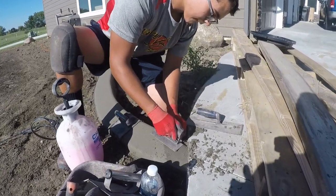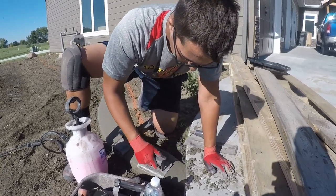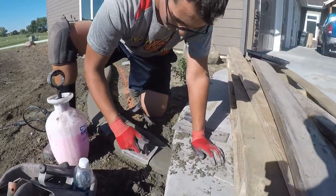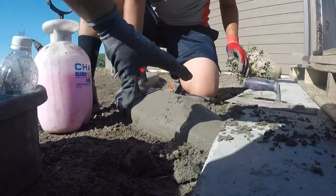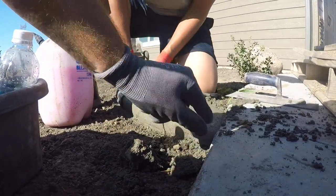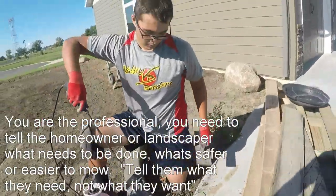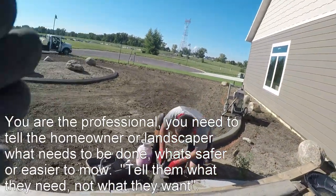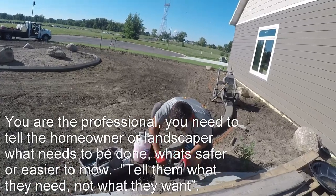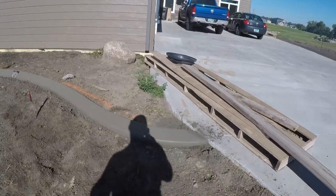Up here we have to think ahead across four seasons and winter is definitely an issue. If we came in more at an angle the way the original line said, it would get really thin at the end — hardly any mud there — and I can guarantee that's gonna crack. So all I did was take that line and come out more at a 90-degree angle, then filter it in a bit so it's gonna be stronger.